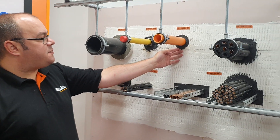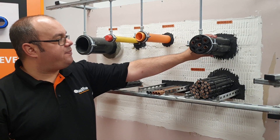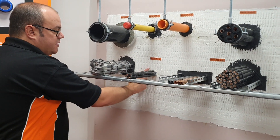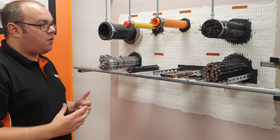We've also got our CPVC using our HPE sealant detail, bundles of metal pipes as previously discussed, and cable applications below — again either using our acrylic sealant or HPE depending on your application and fire rating required.